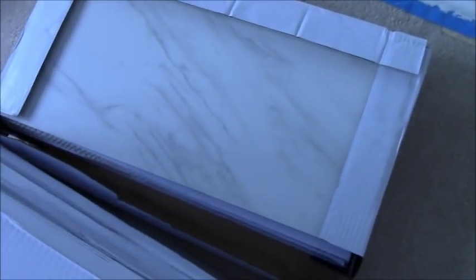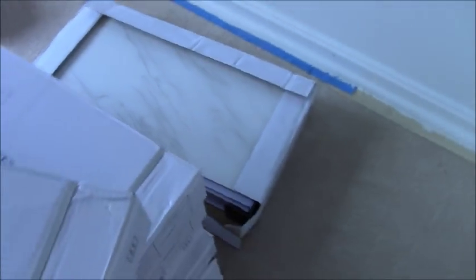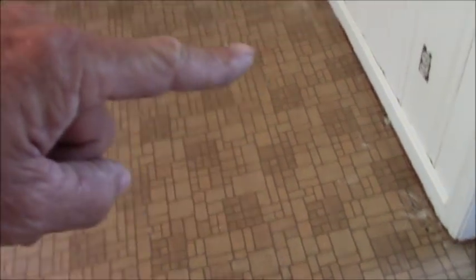All the tile is right here, ready to go. This is an elongated tile, a large floor format — 12 by 24. That will get staggered in thirds rather than in half. So I'm going to stagger it in thirds going this direction all the way across.